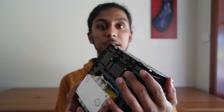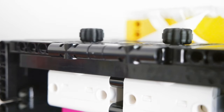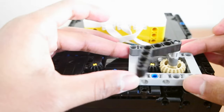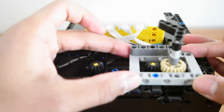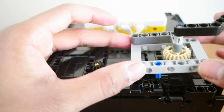A frame system isn't only helpful to make your robot look nicer — it also helps with the final and possibly most helpful tip of all: tip five, using dog gears. These are gears that sit on top of your frame, but underneath they're actually connected to the motors. Your attachment motors will drive your dog gears, which will help drive any attachments that you have. This will allow for making it super quick when swapping any attachments on and off your robot, and as you know you only have two minutes and thirty seconds during the game.